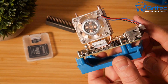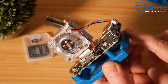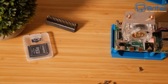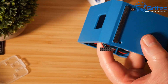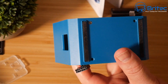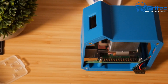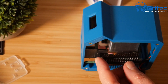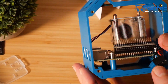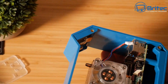That's all now done and you can see we now have it all mounted onto the plastic case bottom part. We're going to get this put into the actual case now. Make sure that plastic lip there is on the side of the connectors, otherwise you won't have it around the right way. Then all we need to do is hold it into position and tighten down the four screws which we took out previously. Once we've done this, it will be mounted inside the case itself. Now we need to put the GPIO edge extender on so we can get access to this from outside the case. Just push this on to the GPIO connectors and push it down — it will be very stiff. Give it a little bit of force until it's all the way down, so it sits flush with the holes on the perspex.